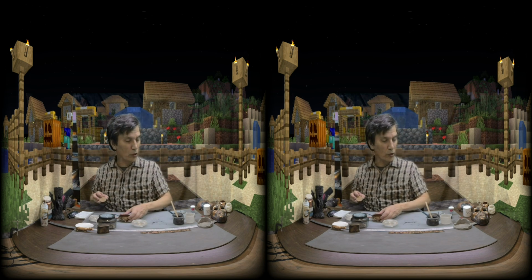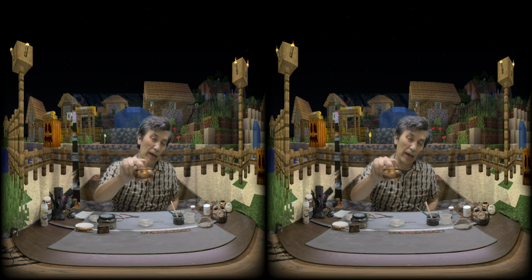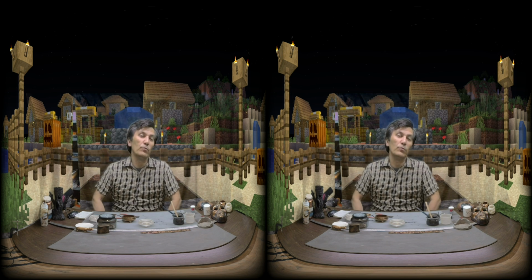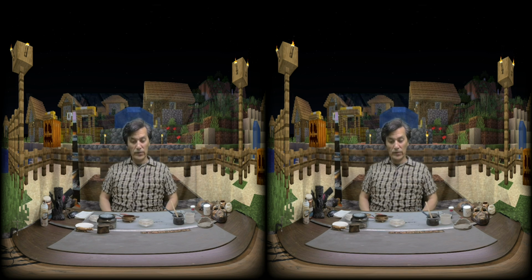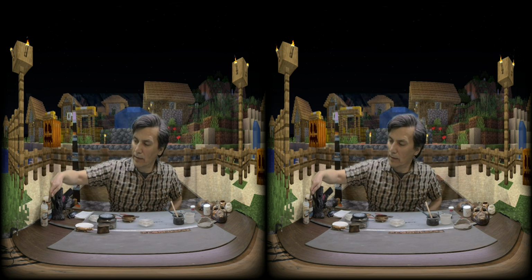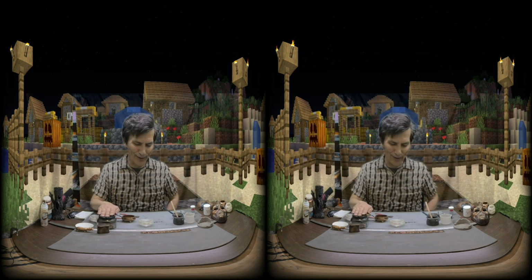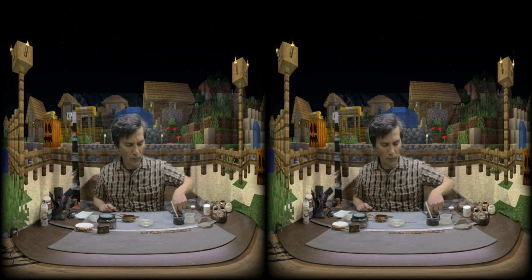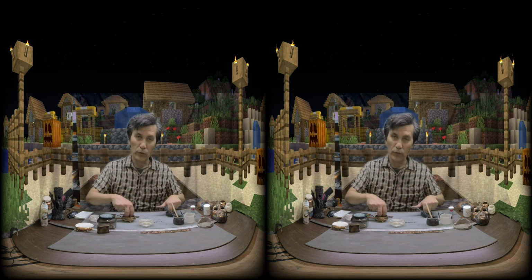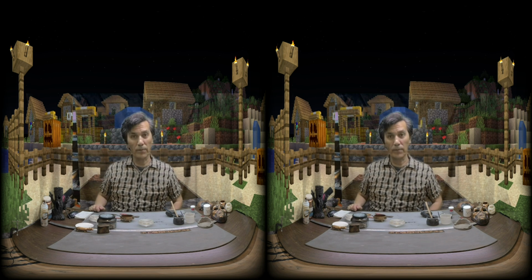So to conclude, to transform something like this into something like that is a process called electroforming. And to do that, you need an electroforming tank, but most importantly you need a material to make things conductive in order to electroform. And today we covered copper acrylic, graphite acetone spray, and this very friendly VOC-wise non-toxic graphite brush paint. Once again, 24 hours of curing time. Stick it in your tank for about 12 to 18 hours. Pull it out, and you should have something like this depending on your tank's chemistry, and then you take it from there. So thanks for stopping by.